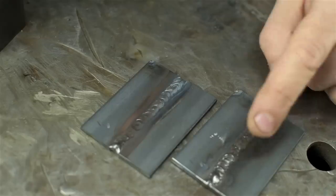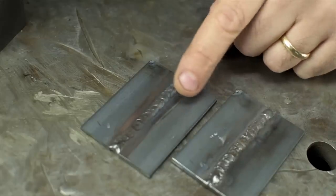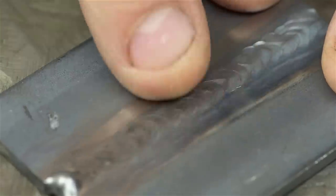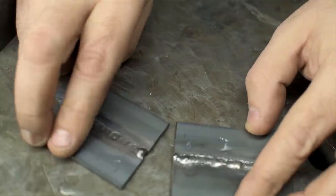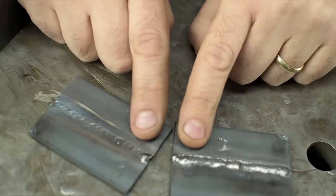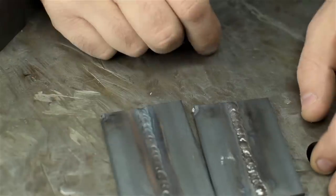I did notice the first one was running a little bit cold — I bumped it up about five or ten more amps. I should have gone a little bit slower. That bead is a bit sunken. Added a little bit too much on the ends, or maybe didn't get out of there fast enough — they started to drip. But yeah, let's not talk about this ever again.